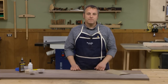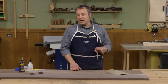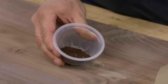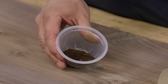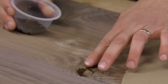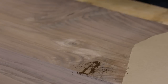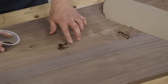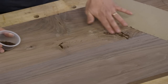There are two ways to do this. The first I actually learned from Logan, and it's pretty genius. It starts with coffee grounds — just dry grounds before brewing, a medium grind for a basket filter. I'm going to sprinkle the coffee grounds into this crack and also into the knot hole, leaving both overfilled so I can sand and scrape them level.